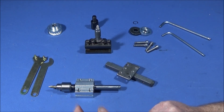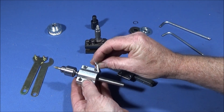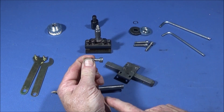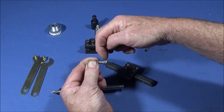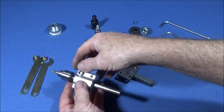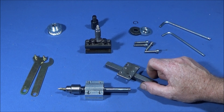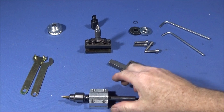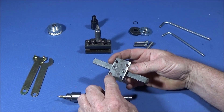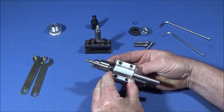It's best to use five millimeter bolts because the six millimeter Allen bolts clash with the angle on the housing. What I did with mine is put them in the lathe and put a 45 degree chamfer on the underside of the head so it can go down nice and square onto the housing without clashing on the angle. If you get five millimeter Allen bolts and drill through for five millimeter you won't get that problem. Once I had drilled mine out for six millimeter, I put it on a piece of five millimeter plate, nice and square, and used transfer punches to get the holes in the correct places — doing one first, then screwing the housing on with one Allen bolt.